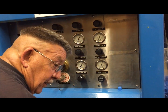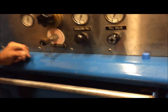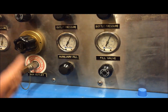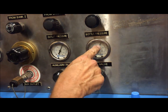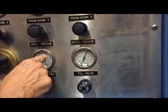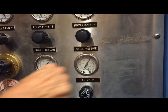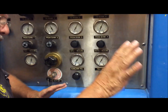Now we'll finish filling. When we shut the blast door you'll hear it pick up, because it activates the system and allows the air to flow back into the cylinder. Right now we're showing a little bit below 4500 on the cylinder gauge, so we just hit it a little bit — you can hear it bringing it up — and right there we're at 4500. Then go ahead and hand-tight.